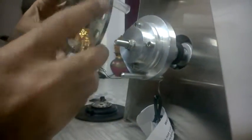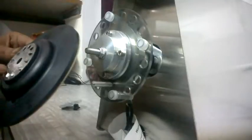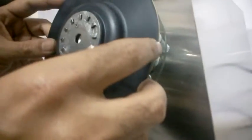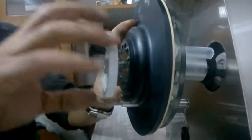There is a guide and a hole for the guide. Align this hole with the guide and push the vial holder in. Once it is set, push the lid of the vial holder back on, then tighten the aluminium locking knob by turning it clockwise.